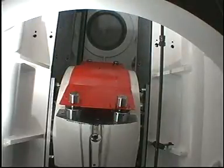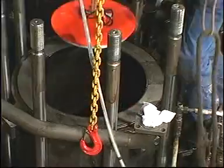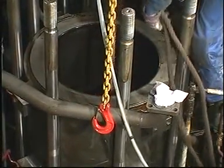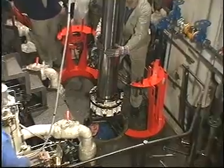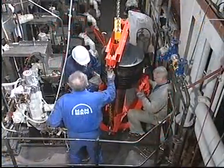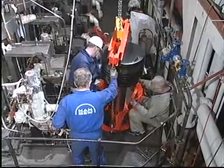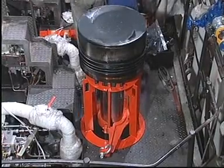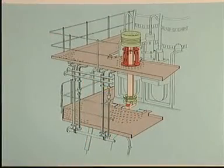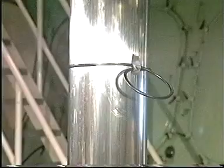Place protective covers over the crosshead and in the bottom of the cylinder unit. Remove the cover from the cutout in the gallery floor plate and land the piston on the support tool. Before starting the overhaul, tape a new O-ring to the piston rod above the stuffing box housing.